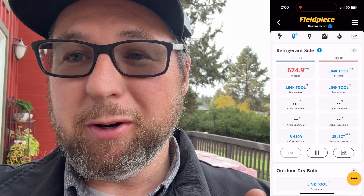While I've been on hold with Lennox trying to figure out what an E1 code is, it's definitely not communication. I ran it in cool and it ran for a long time with no issue. I put it back in heat, hooked up a gauge, and look at how high the pressure is in heat mode. The fact that there's a dye sticker on here tells me somebody charged it without weighing it in, they overcharged it, and that's why the pressure is going too high. E1 is probably saying high pressure shut off. We're gonna check the indoor coil and make sure the filters are clean because dirty filters can also cause high pressure.